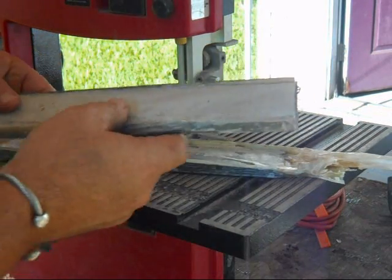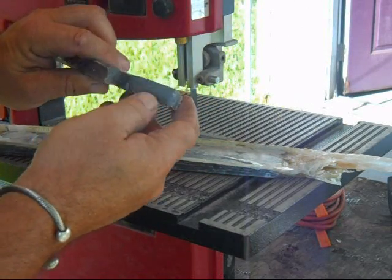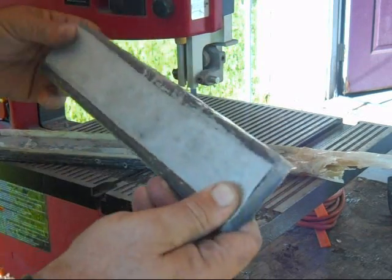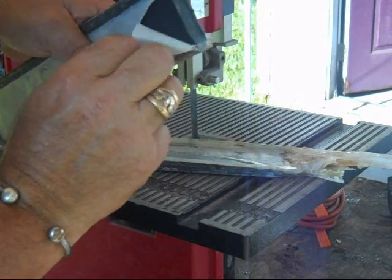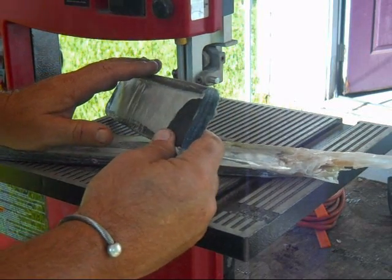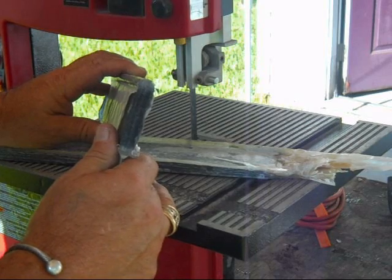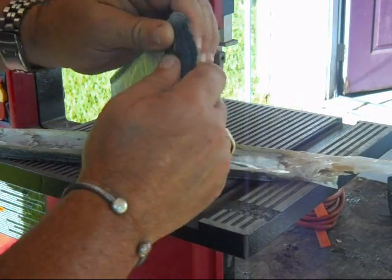But I've on occasion done one, or may have had some attempts, and you can tell by looking at that it did not set up as appropriate. And I don't know what the cause was. Maybe somebody who works with fiberglass a lot could tell me. But I was using the same amount of hardener and the same amount of resin that I've used on other batches. When that happens, what I do is I just throw out that tube of hardener and move to a new tube. But it hasn't always been the entire tube. I don't know if impurities got in or what, but not every attempt has been successful, so just something to keep in mind.